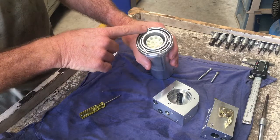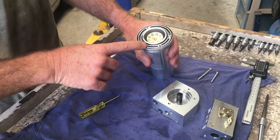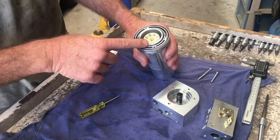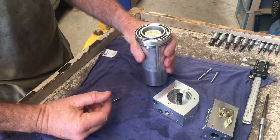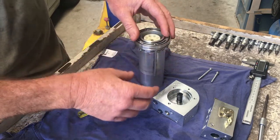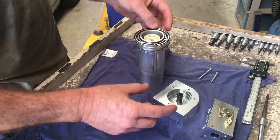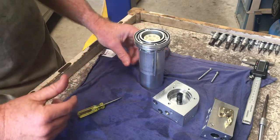These O-rings I've found pretty difficult to source. The outer one is a 1.75 by 70 millimetres, and the inside one is a 1.5 by 50 millimetres. They're pretty skinny, so sourcing those might be a bit hard. However, they are not high-pressure lines, and you can pretty easily put them on one at a time and see if they've actually been compressed too hard, or whether they're actually going to seal against this correctly. And if you've got leaks there, then that's actually where you would go to fix that.